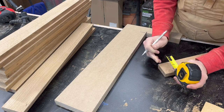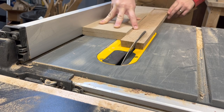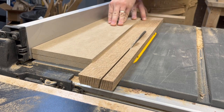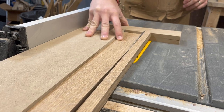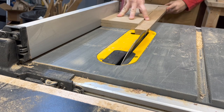Then I'm going to mark the width of the bottom of the board, because this is my known endpoint — the exact width that the calculator spit out for what the bottom of each board should look like. At this point I'm not really concerned about the overall length. As long as one end is the exact size I can cut it down to size later, and then each board will be the exact same width on both ends.